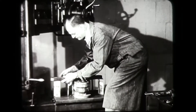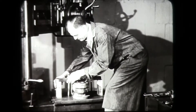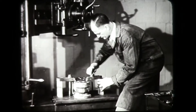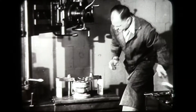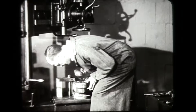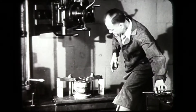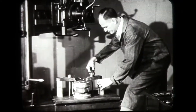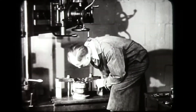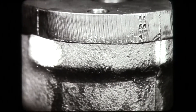To carry the load properly, the washers under each nut must be larger than the openings in the clamps, and the threads on each bolt must extend below the tops of the clamps. The center marks at each end of the jig and on the sides must line up with the reference marks on the piece.